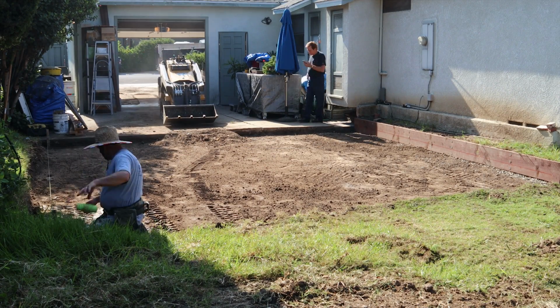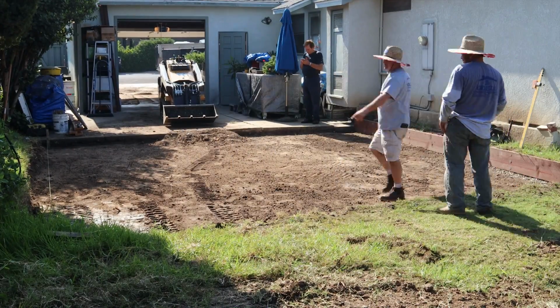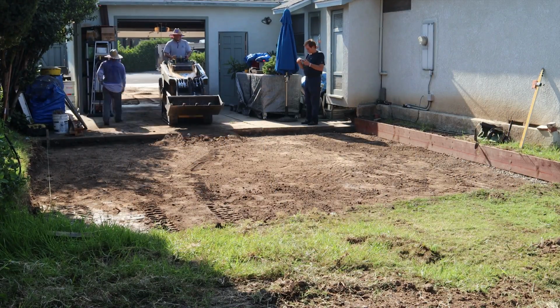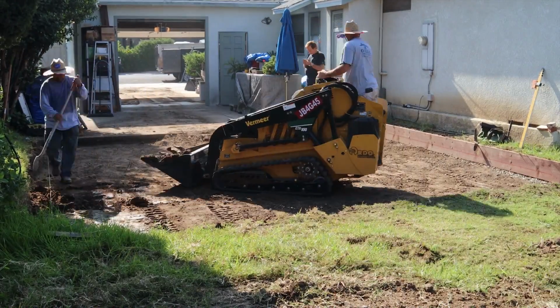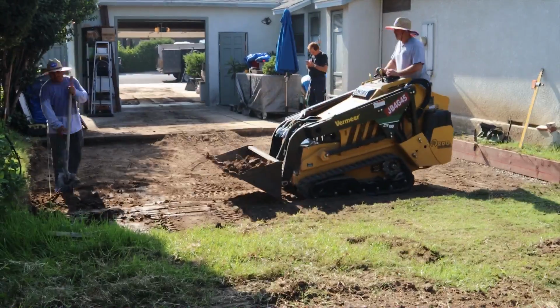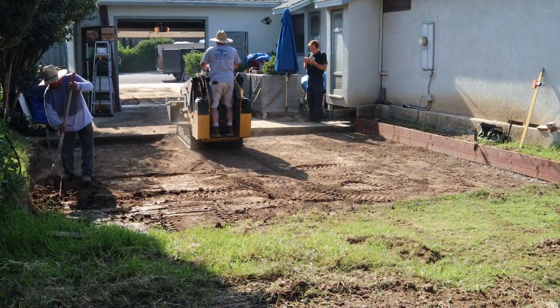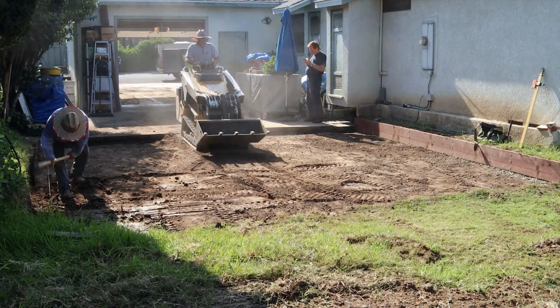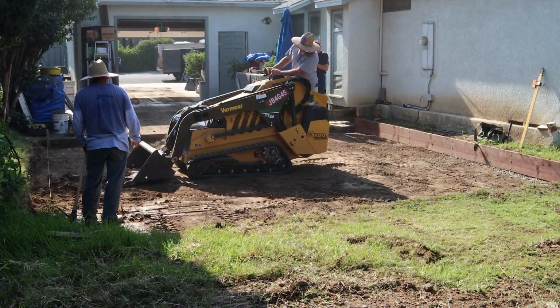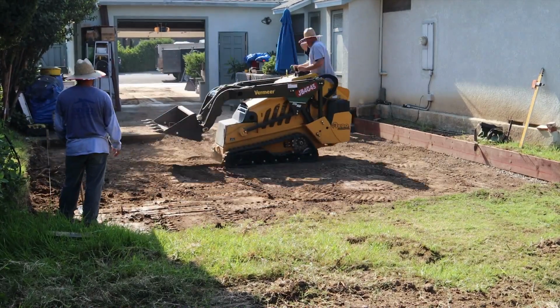So we just pulled our 22 feet off of that 2x12 retainer. We paralleled it, and that's parallel to the house, so we know we're looking good. By my first eyeball on the excavator, I got it close, but once I put some lines up, we noticed we were still a little high along those Italian cypresses, so I'm going to cut it down a little bit more.